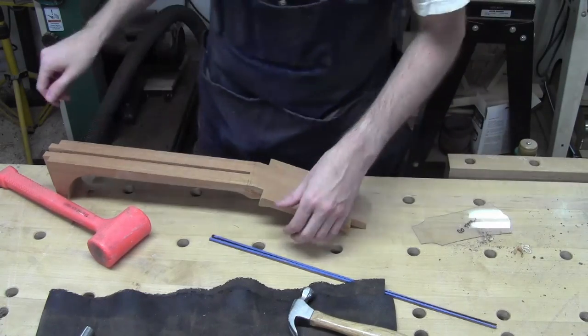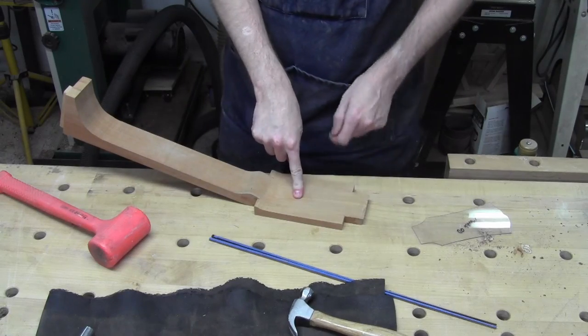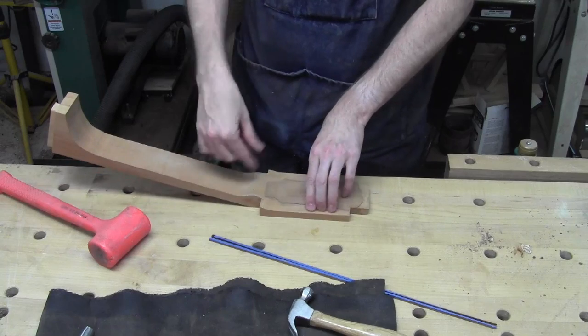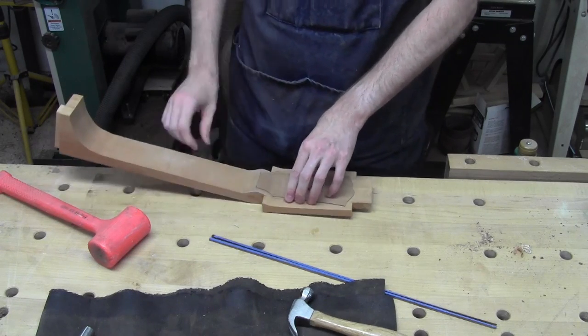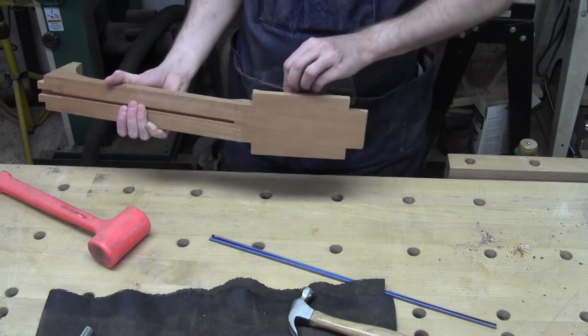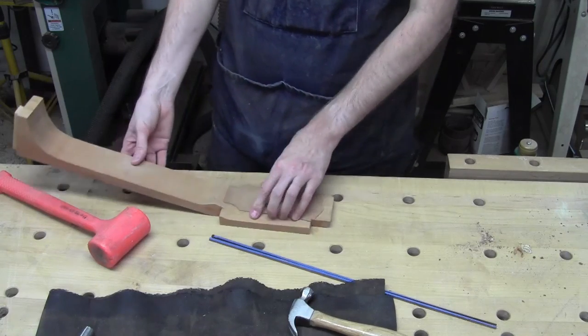And it's always a challenge because I'd love to be able to do it like this, flat on the bandsaw and just cut, but sadly, the templates and the patterns with my volute and all that sort of stuff makes it tough to do that. Because the zero is way up here, the fret, the nut is way up here. And my volute gets in the way. It always curves there.